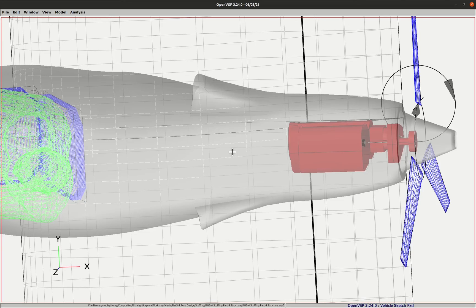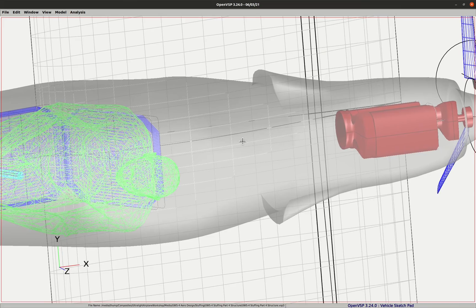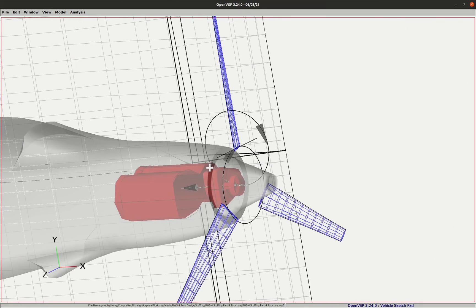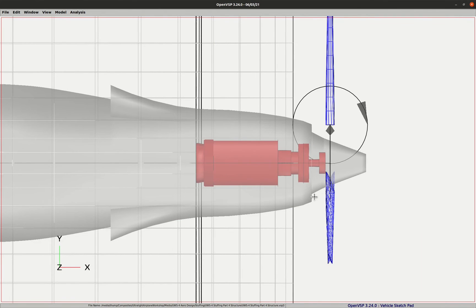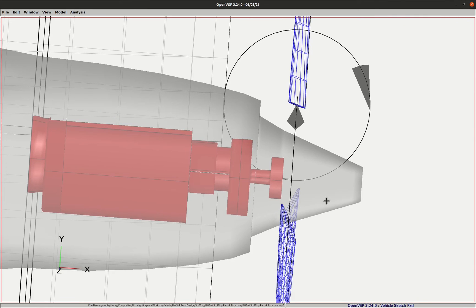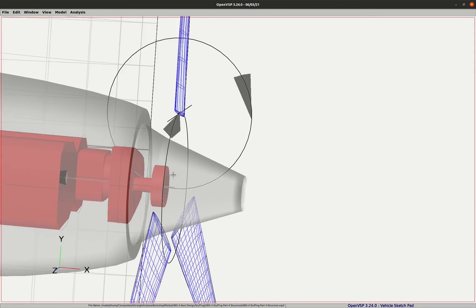As you can see, we have two inlets about 2 inches by 10 inches each. Adding those together gives about 40 square inches of inlet area, and we calculated 39 square inches — so that works out well. The outlet is at the rear — a circular opening where the cooling air exits. That rear outlet area is about 80% of our inlet area. As for the rear cap or cone on the trailing edge, I'm not sure I'll include it. The airflow around the back and the cooling air are likely to be turbulent enough that I don't think the cone would reduce drag. I may experiment with it, but I'm inclined to just truncate it there.